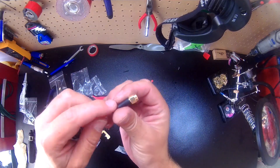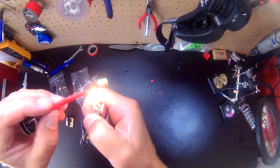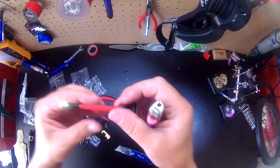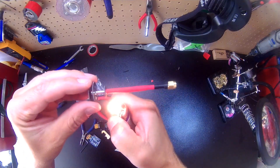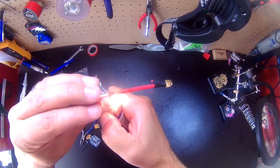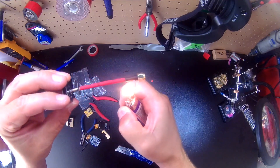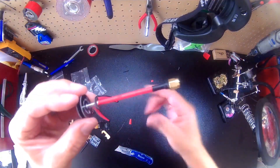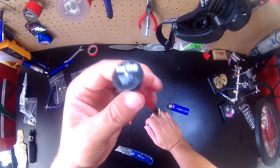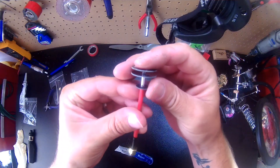Slide this down. There's a little bit of a breeze in here today. Remember, never get your heat shrink in the flame or it leaves a black spot. Now, this part's important — this is one of the big complaints about these antennas. If these two plates bend, you lose your frequency.